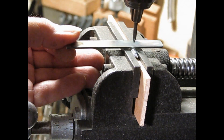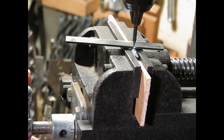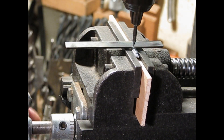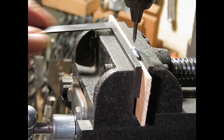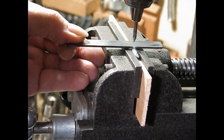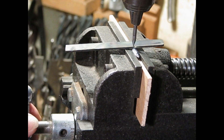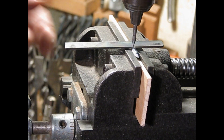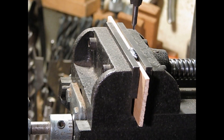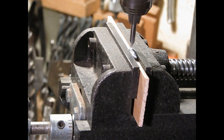Finding the midpoint of a round object in the vise. You put a little pressure on the quill — it's just level — that's your point. I changed out the spotting point for a spotting drill. Now the spotting drill is designed to go straight in right where it touches, without taking a little walk around your work.